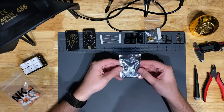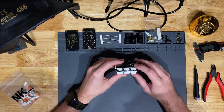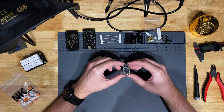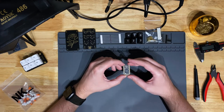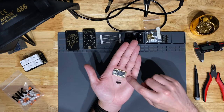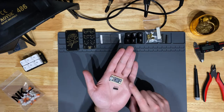Normally this kit comes with a Pro Micro, as many of these kits do, with a micro USB and headers. I wanted to make one that was USB-C, so I got an Elite C, which is a drop-in replacement as far as QMK is concerned for the Pro Micro, but it has a USB-C port. It also comes with an extra header because the Elite C has extra pins, but we're not going to be using that.